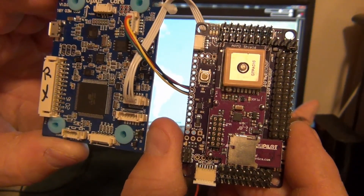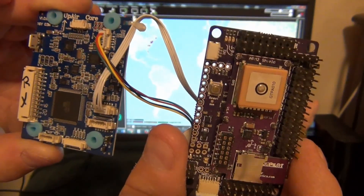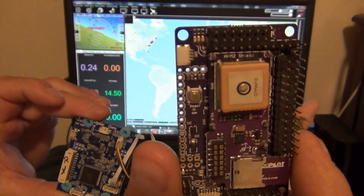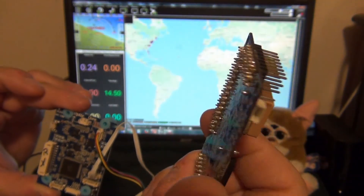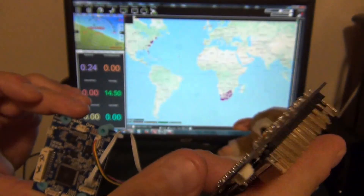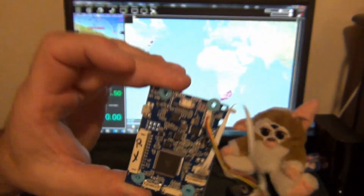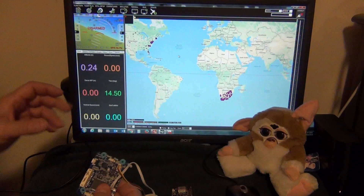What I mean is: the standard Arduino board just has pins like Futaba pins sticking out, so you can put any type of cables to it — servos, everything — because these are made for almost anything from a robot to an airplane to a multi-rotor to a helicopter. The holes that are drilled line up with the Up Air's holes, so if you ever blow your APM board you can buy one of these. They're fairly cheap because they're older — version 2.6 or 2.8 — so no one uses them anymore. But with the USB mod you can save the params and copy them to this board.